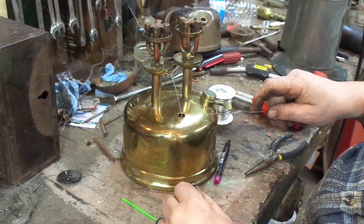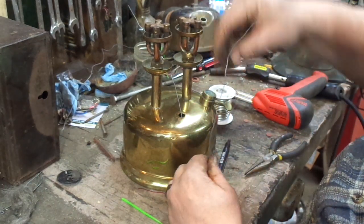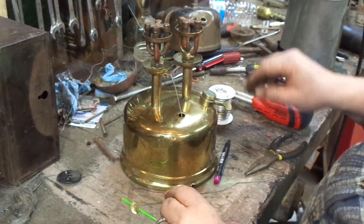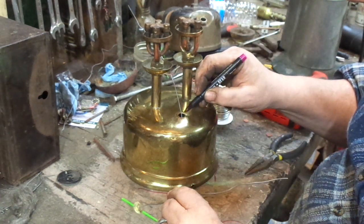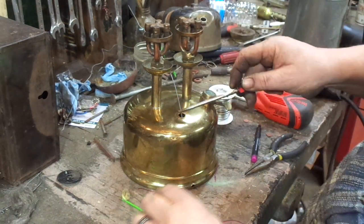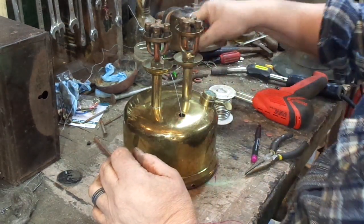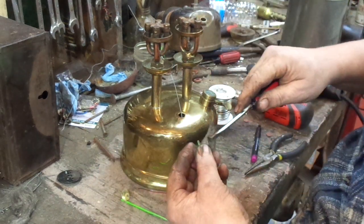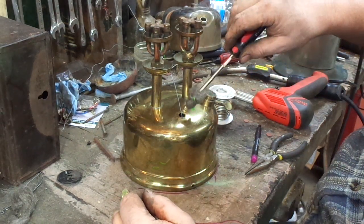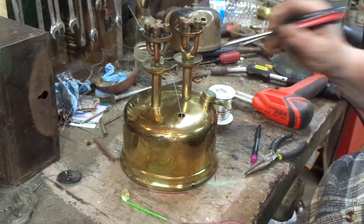The hard part about doing this whole thing is to bend your wire and get it down to come out your hole. Once you've got it in, you can just pull it right up into place. Now what you've got to do — and this is critical — make sure that the back of this hole doesn't have any burrs on it. I have a screwdriver that I repurposed as a scraper. I can get in there and pull the burrs off, then put a little piece of steel wool over it, put some flux on there, and clean up the inside of this ring.